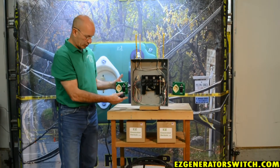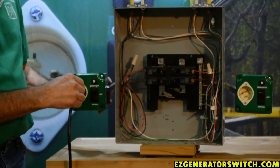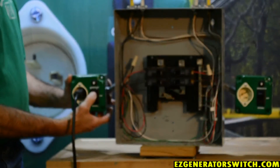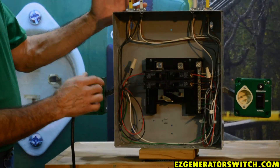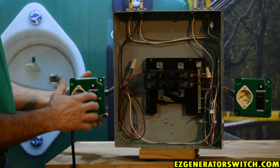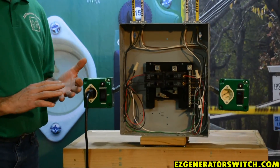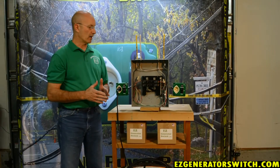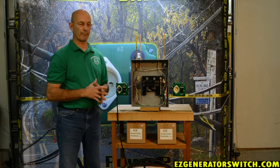You've plugged into the generator. Take your switch and go to the off position. Your generator is running — take your cord, plug it in, then switch the generator on. Now the light circuit which we wired from that breaker is running. We are not touching any of our breakers, we're not touching our main. There is no back feeding — real transfer switches do not back feed. That is a fallacy from people hot wiring things.